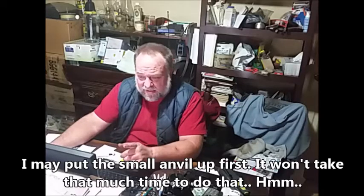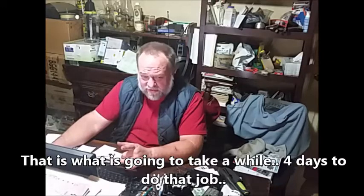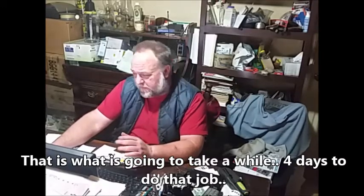In this video, that anvil is still in its regular state. All the cracks and mushroomed edges, of course, they've been ground down, but it's still flat. It's got a belly in the center and all that kind of stuff. You're not going to see that, but if you want to see somebody put a tool steel 4140 piece of plate steel and a step on an anvil, what it takes to grind it down, groove out the cracks, weld it up, heat it up, you can look for a video on a reconditioning of an anvil.